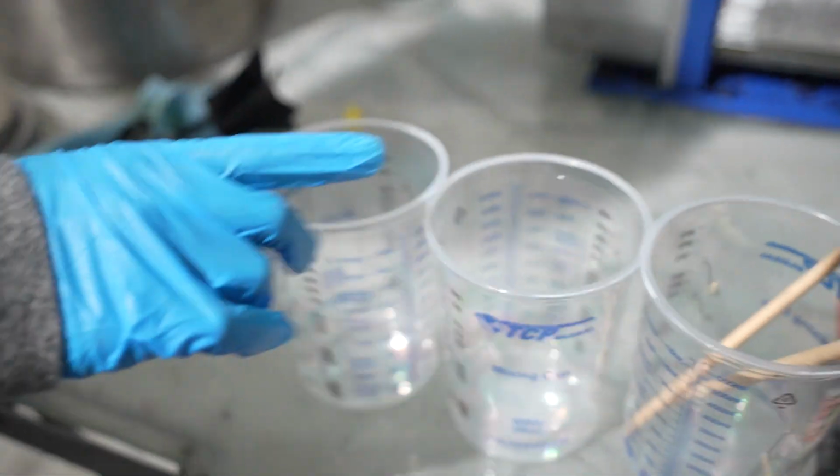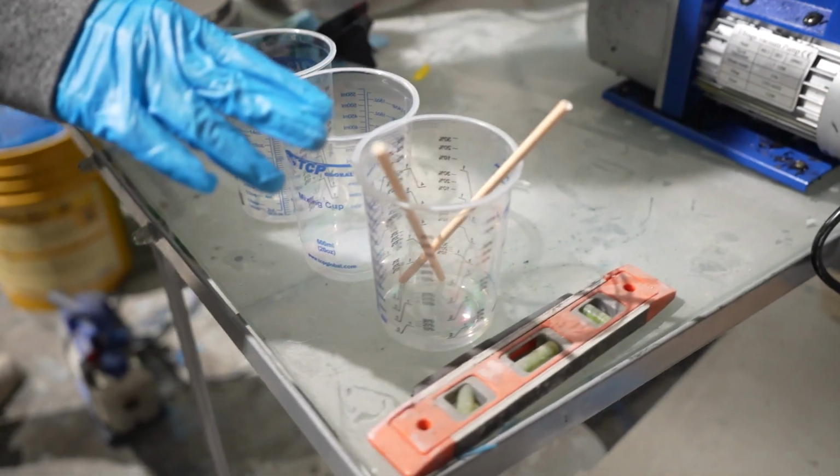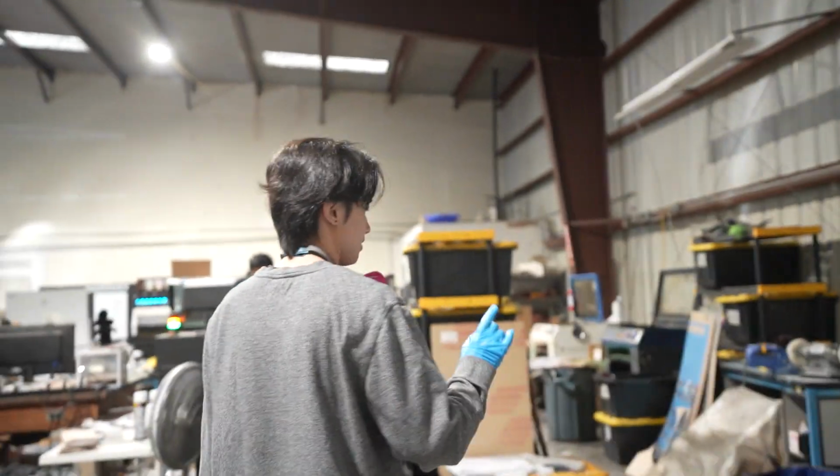All right, so next step, after you guys got the mold done, you're gonna wanna do the clear resin pour. The tools you're gonna need are basically a scale, mixing cup, mixing straws or sticks, vacuum pot, pressure pot, mold, and we have it over here, the resin that we're gonna use.